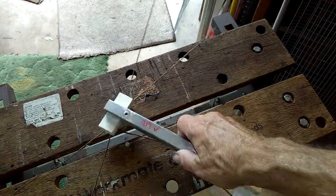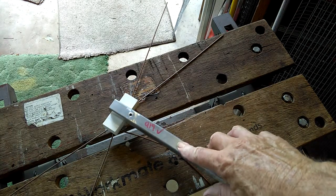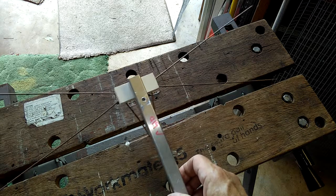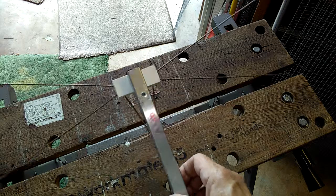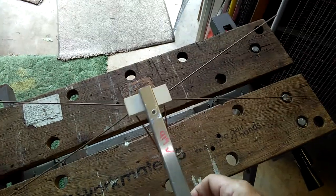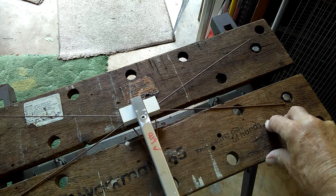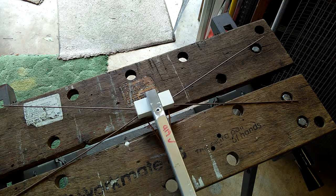All antennas are built along some type of center line, some type of backbone, usually aluminum, and that lets the signals just naturally flow over the element like they should. Now, if you use a reflector, there's a distance between your element and your reflector, and the reflector reflects the signal back. That still allows for that flow. Don't mount it on a piece of plywood and expect it to work well. It just won't, or you'll just be disappointed.